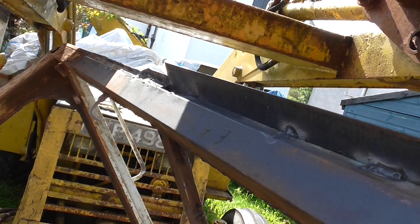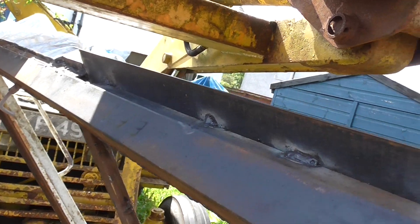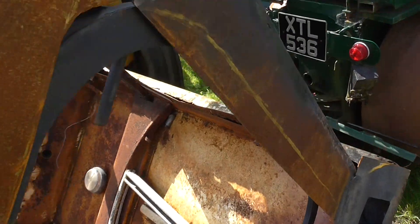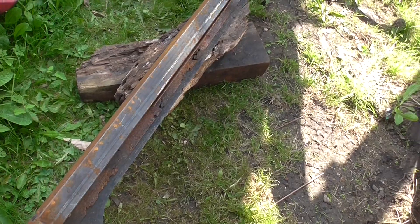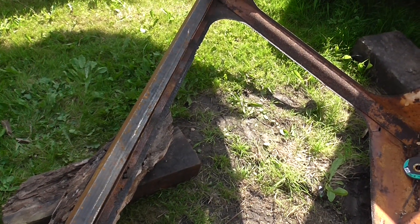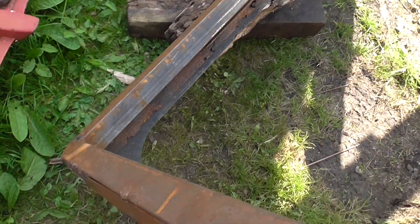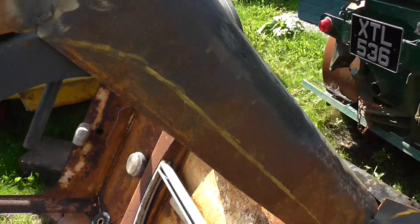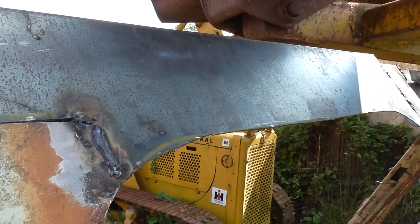I had to custom make it up that end because the cab actually tapers from there. So the back is, as I say, getting there now. The next job is to remove the outer skin on the right-hand side, which is the long window side. That skin will be removed and completely replaced as this one has been. That's 2mm mild steel.